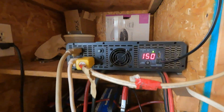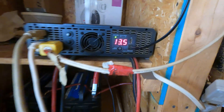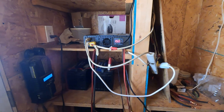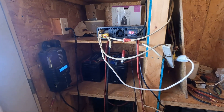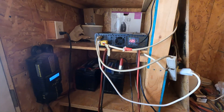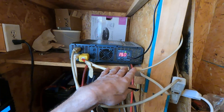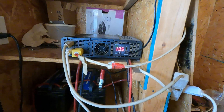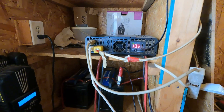The fridge just kicked in. The fridge uses 120 watts. I've also got Wi-Fi and TV — between TV, Wi-Fi, and other things, it's using about 35 watts at idle. As soon as the fridge kicks in, it shows 150 watts total, but just over 100 of that is the fridge. It's an 18 cubic foot fridge. Power creates heat, so there's a fan running on the charge controller too — when there's a lot of power coming in, you get heat off the charge controller.